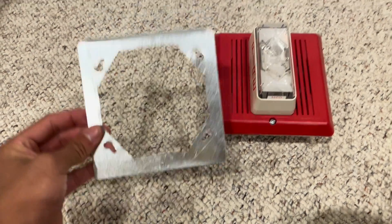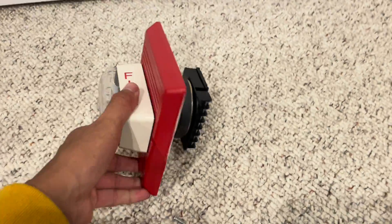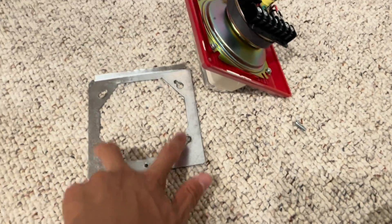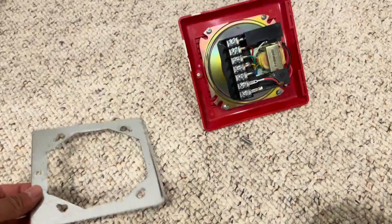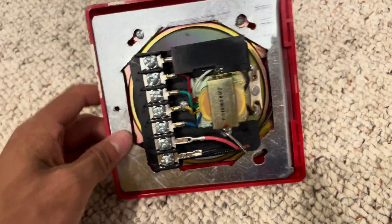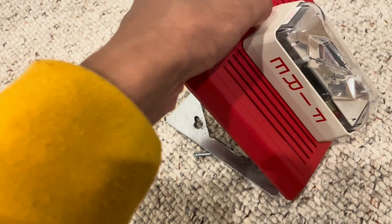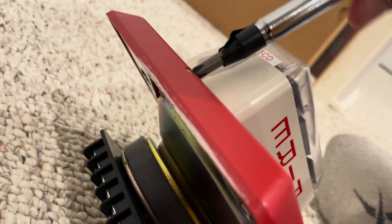Welcome home. So I have the bracket here — I brought it home. This is the speaker strobe I made it for. It's missing a mounting bracket so obviously you can't use it. This one's actually easy because some units you have to make the mounting bracket with wire contacts, but this one just wires to the device, so it's really just a mechanical fixation. You can see this is the bend — it's meant to latch into these tabs, and it does! And the screw appears to line up. Let's get the mounting screw, feed it through the hole, and screw it in. Look at that — screw's in. I'm not going to over-tighten it because I know it will strip out. But look at that — this will hold the unit to the wall, which is really all I'm looking for, and it does look pretty legit.